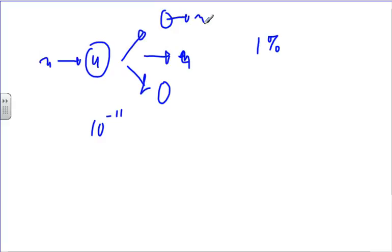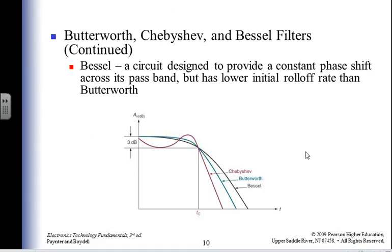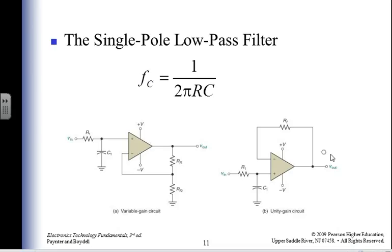And when I shut down the plant, the same thing is true. So I have decay heat. I shut down the plant, I drop my rods, my power level goes down. Now I still have decay heat going on because the nuclear reaction is still going on, caused by those delayed neutrons. Anyway, back to where we were. Chebyshev, Bessel. Yeah, but without Bessel, we never would have known how to control a nuclear power plant. And he died before we had the first one, but that didn't matter.